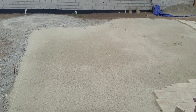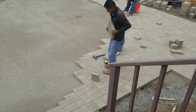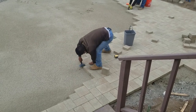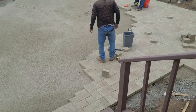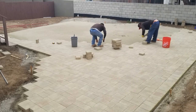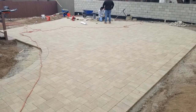As you've seen in previous videos, when laying out pavers you lay down the base, compact the base, lay out the leveling sand, and then start laying the field. The field is the main part of the pavers and goes pretty darn quick. You establish a pattern, and the great thing about these four different size pavers is that they come in lots of different patterns. The tough part is the perimeter, where you have to do a lot of little cuts and anchor that with concrete.